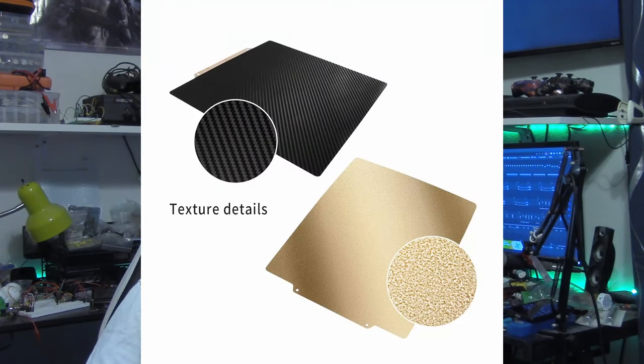It's also here where I saw another person's review mentioning that you can take out the bed screws, so now I'm armed with that knowledge. I returned that bed because it simply wasn't capable of doing what I needed. I then bought a different double-sided bed because it was the right size — a textured PEI and light textured PET. PET is like PEO but with a carbon fiber style design rather than the crystal style. This is what I wanted from the start because it was the same style as on my P1P; I just didn't get it initially because I didn't know about the alignment screws. I was sure it would work because it worked so well on my P1P. Wrong — it functioned the same, possibly even worse than the last bed. So I returned that one as well.